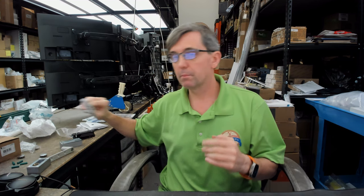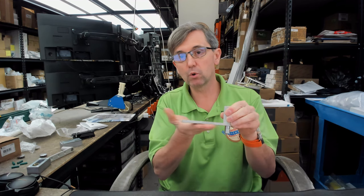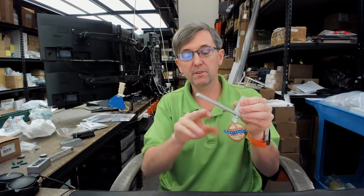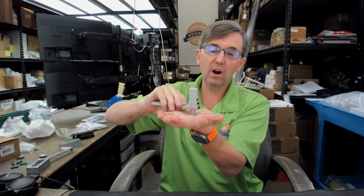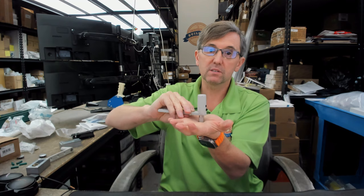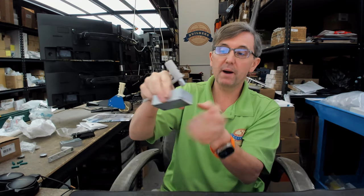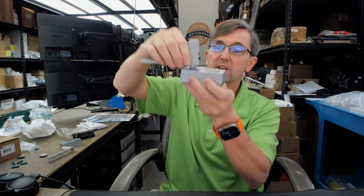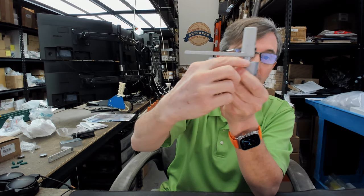Now, the clearance can be anywhere from 3/8 to 1 inch. Clearance is the distance between the bottom of the door and the floor, assuming this is flush to the bottom of the door. You set that once the door is in place. It's going to be sitting all the way down at a minimum height of 3/8, because this pin is buried down to the bottom of the casting. When I set this in place and measure this dimension, it's 3/8.